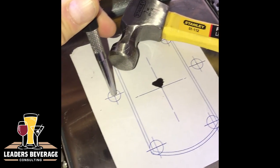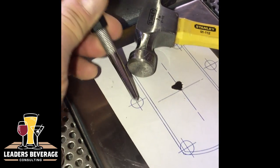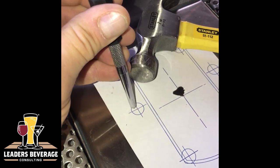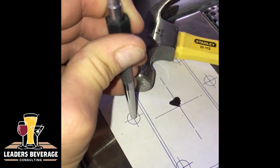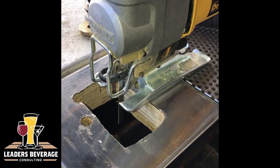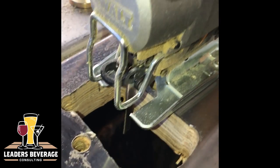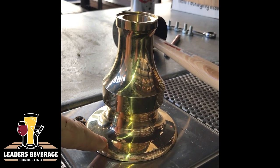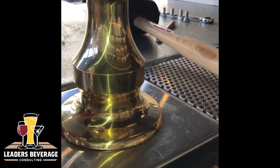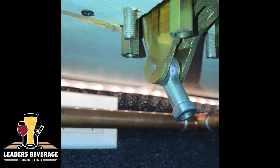Something like this is very precise, especially with stainless steel, and you can't afford a screw up. So what I use is a punch to make a nice little notch that my drill bit will be able to follow. What we did was use a jigsaw with a metal blade so that we could slowly cut out. We shaved in there with that metal saw millimeter by millimeter so that this would be as absolutely tight as possible, and that way it won't move around as much.